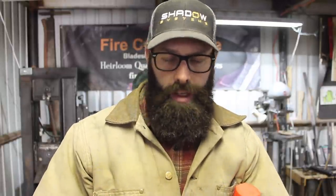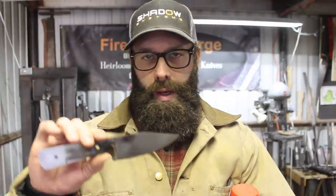You're not supposed to use this for direct contact with flames, even though there are flames on the thing — the back says not to. So we should be fine in the kiln with no direct contact with flames. I'm hoping that I can use this to re-heat-treat this blade and not run into any kind of decarburization and scaling that we would need to grind off, because we don't really have anything to grind off.